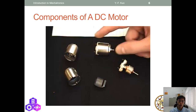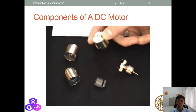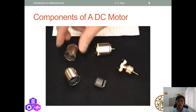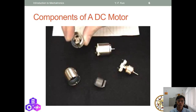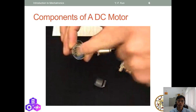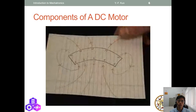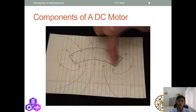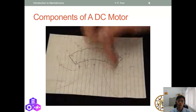Let's watch a short video to understand the parts of a DC motor. This is a small permanent magnet DC motor rated at about 1.5 to 3 volts. It consists of an outer stator with the rotor inside. You can see permanent magnets on the inside of the stator housing providing radial field lines that interact with the coils of the rotor.